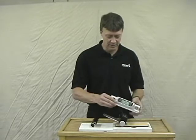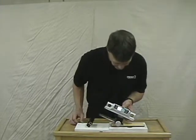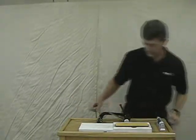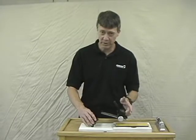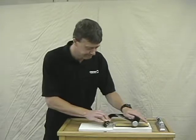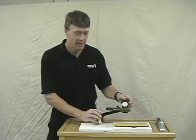To set the angle you can set a protractor on the top of the grind and hone while it's sitting on the stone and then read directly the angle that you're going to put on. Right now I've got about 24 and a half degrees which should be just fine. You want to lubricate the stone. Put two hands on the jig with light pressure — one hand here, one hand here — and that should be all it takes.